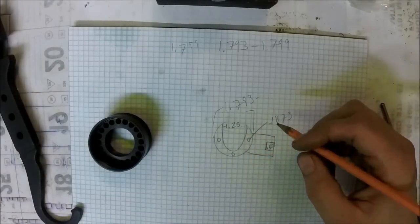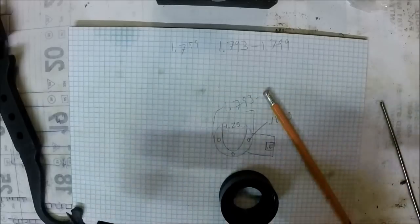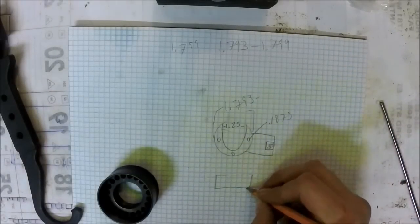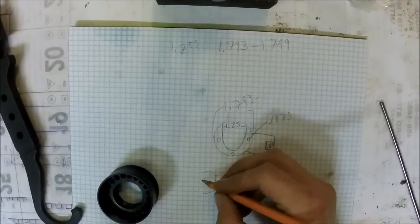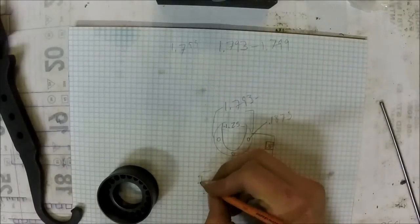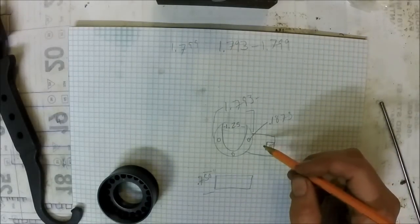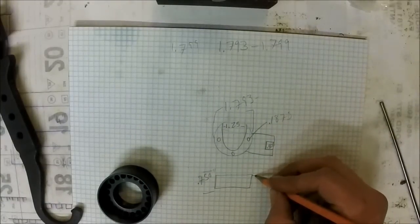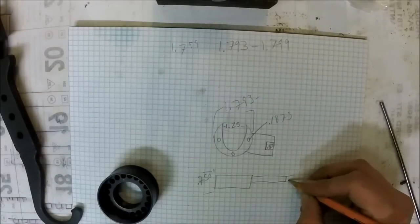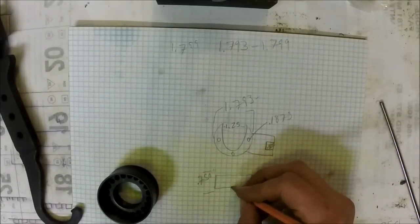So I'm going to take a quick measurement of the height, this to the bottom here, is 0.46, so I'll make it at least... let me make a side drawing here. I'm thinking 3/4, not writing 750. So we'll go 3/4 inch thick or thereabouts. I've got some 1/4 inch flat bar sitting around that might work for this. So we'll see if that'll work or not. And then the pins will be coming out this way.